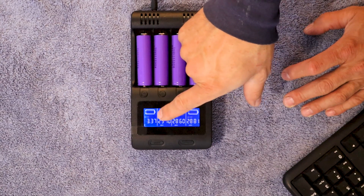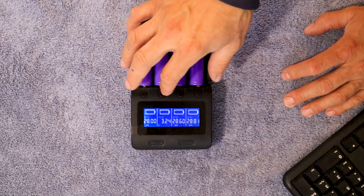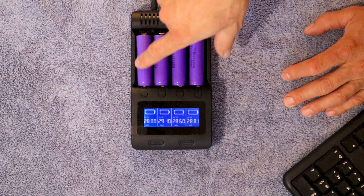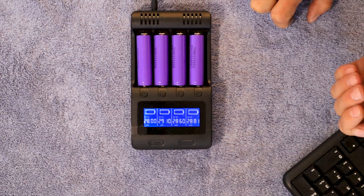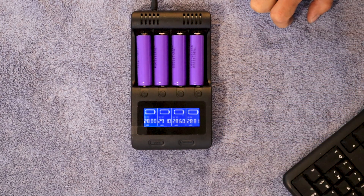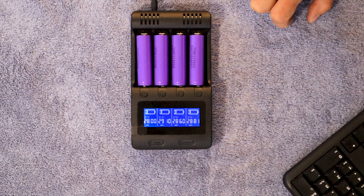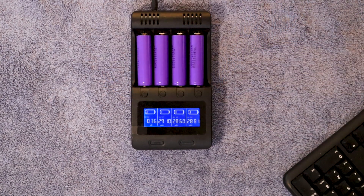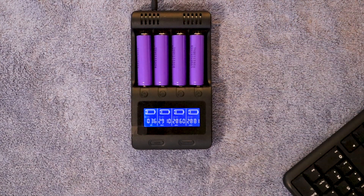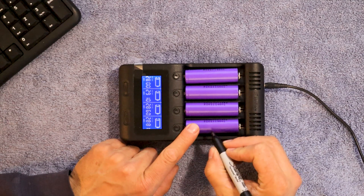This one's at 3.37 volts — it's actually starting to charge back up, the test is done. This is what I ended up with for milliamp hours in each one. I've noticed that this charger reads them a little bit high. These are 2600 milliamp cells, so seeing them go up to 2700 wouldn't be uncommon, but up to 2900 is uncommon. I think this charger takes the voltage a little lower than it should for testing. But it doesn't matter because I'm just trying to keep the cells even between each other. When they're done I just write down the milliamp hours on the cells with a Sharpie.